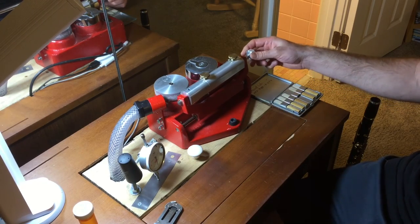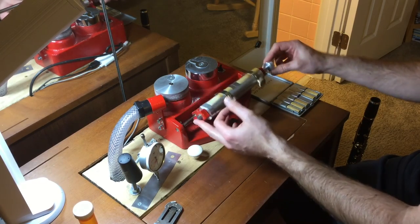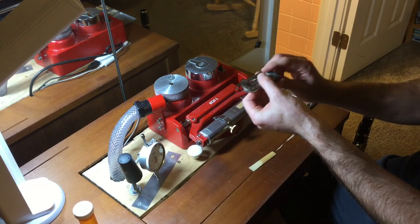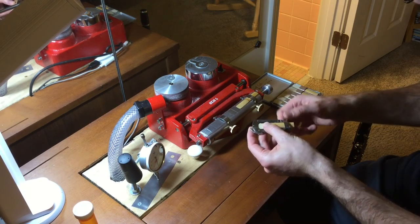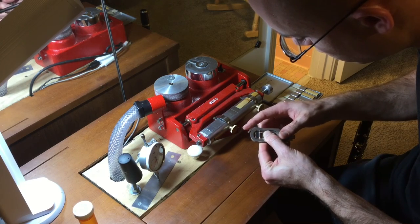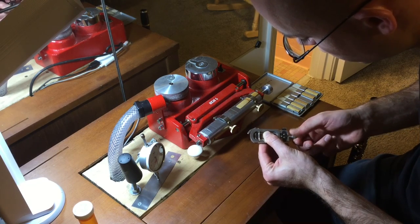Theoretically there's a little bit — it shouldn't grab the reed at all, shouldn't turn that sanding plate at all, because that should all be gone, but nothing's ever perfect. So then I take this little machine called a reed clipper, line it up just so, and it clips it to the shape of a reed.